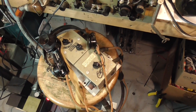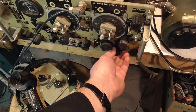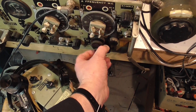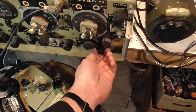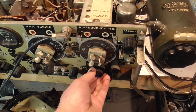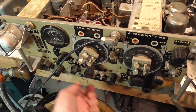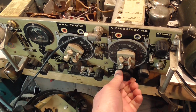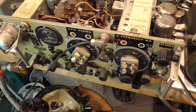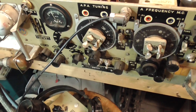Right now we're just tuned into some stations on 80 meters. Let's see if we can hear this guy — this is a sideband station, and these radios are not actually intended to receive sideband very much, but it can be done with some very careful tuning of the dials. Let's see if we can find somebody on AM instead. There's a nice station right there — so not doing too bad.